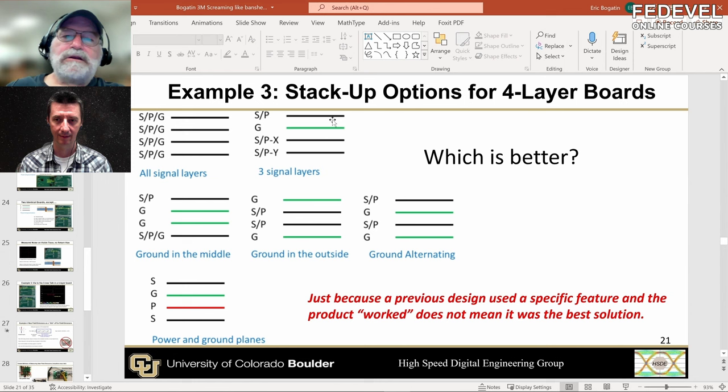If it's a thick board you may not see that effect, but if it's a large board you might. I've seen this a couple of times — sometimes just the PCB itself may be fine, but once you run it through assembly, it can get really bad. The general guideline says, not for electrical but for mechanical reasons, you want to use a symmetrical stackup with comparable copper distributions on the layers. It's not just islands of copper — the connections must be consistent so that stresses are the same, not just isolated islands.